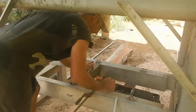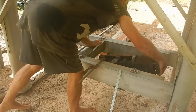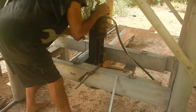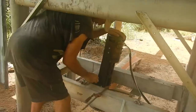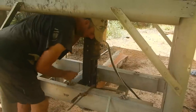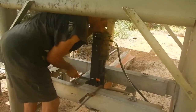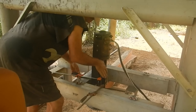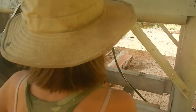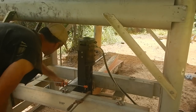Yeah, that's fine. Yesterday, when I was testing the vertical and horizontal cut, when I put this up all the way, it was a little bit too far this way, so I've made a little shim, and it appears that puts it right at the right size. So I guess I'll rivet that on later. I'm not doing it right now because I don't feel like it. Yeah, with that little spacer, it'll cut a vertical and horizontal and actually have them meet and take off the piece.